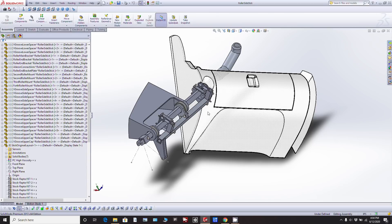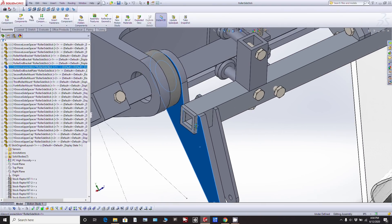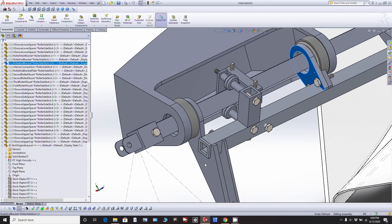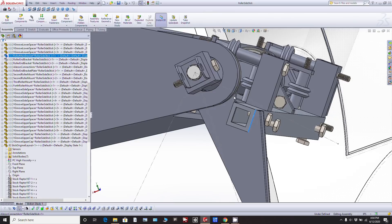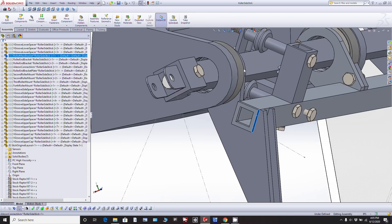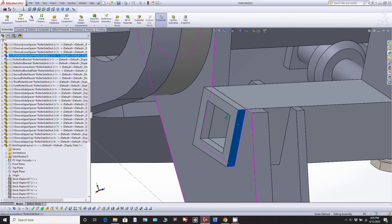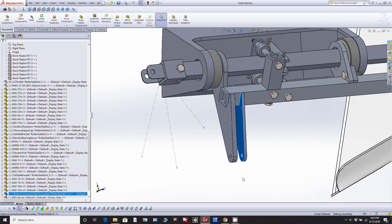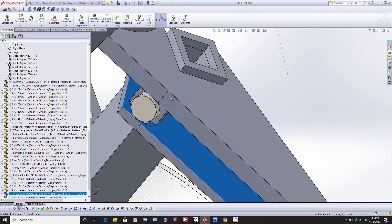Let's take a look at the last few additions I did to the side stick design. There wasn't much left to do. First of all, I changed this bracket up here — I made it quarter-inch thick again, the same as this one, so it's stronger. I've got this one sticking out here so there's an area to weld around the edge, and I basically slotted it out so it's easy enough to cut from a single piece without doing anything super fancy. This actually makes the clearance for where the air conditioner unit is on the left-hand side of the ship, so that can live in that area when this thing gets rotated all the way up to this angle. Then I got a secondary bracket there which basically mimics that one, so this is in double shear where it connects to the aileron control rod.